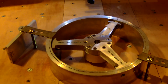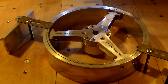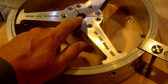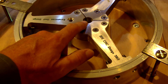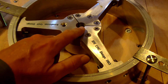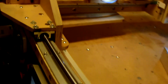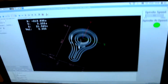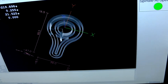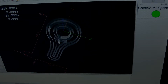So the setup was done. On the wheel we have to make zero on X and Y just in the middle here, so I use a caliper to be sure to be in the middle. The program was made as usual and you can see on the screen what the milling operation would be and the pocket created.